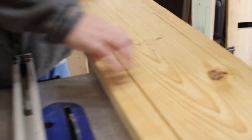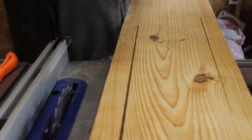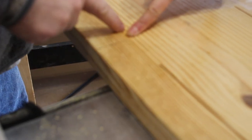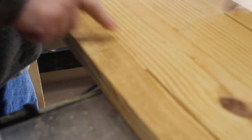So, do you want to see what we just did? Yeah, we're cutting the side so we can have the middle part that's going to be inserted into our bag. And the reason we stop before our line, as you notice, is because if we stop here, the saw would have cut way through in here, because of the curve of the blade. Right, because of the curve. So we're going to finish with our jigsaw. And you can see what it did over here.